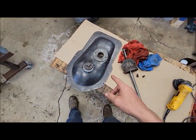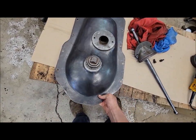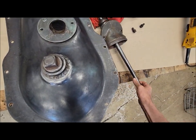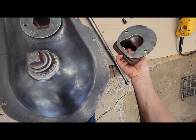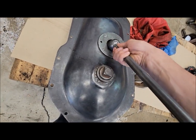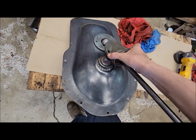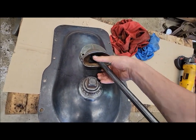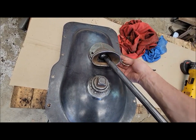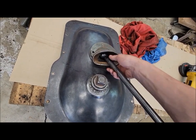Anyway, what I've been doing, I got this top transmission cover and started to clean that up. Still a lot to do yet, but I've gotten started on that process. I got the rest of it started to get cleaned up. We'll have to make a new felt seal for the ball here. That's what seals it up from the transmission in the cover here. And then there is a shift boot, like a canvas or cloth shift cover boot, that will have to get made up. I think there's like a wire that goes in this groove to hold it in place, and then I'm guessing another little wire to seal it to the shaft here. So that's another future project we'll have to do.